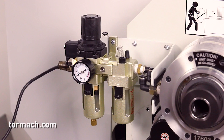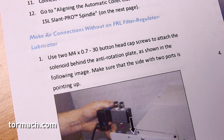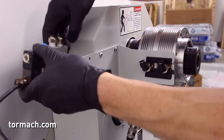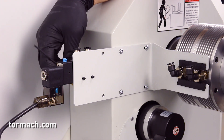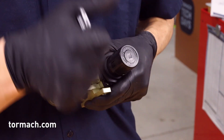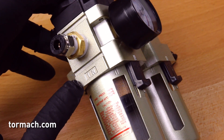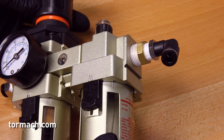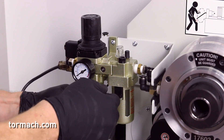Making air connections. You must make sure that the air to the solenoid is dry, filtered, and regulated. If it is not, we recommend you use a filter regulator lubricator. If you are not using an FRL, go to the technical document for the instructions in the making air connections section. Use two M4 button head cap screws to attach the solenoid to the back of the anti-rotation bracket. Follow the instructions included with the FRL to attach the NPT reducers. The push-to-connect fitting attaches to the input side of the FRL and the elbow attaches to the output side. Then attach the FRL to the front of the bracket with the M5 button head cap screws.